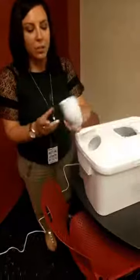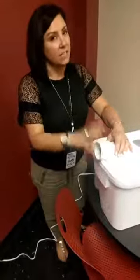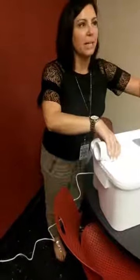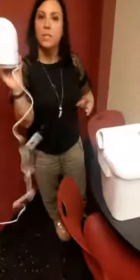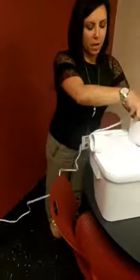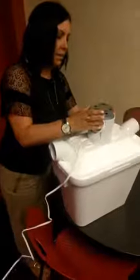A standard styrofoam cooler — it's the poor man's air conditioner. These little PVC pipes are about a dollar at your local hardware store; you can use metal ones too. It's a small cooler so it's not going to give an arctic blast, but it should work. Fill the cooler with ice, cut holes in the lid based on your fan size, and place a small fan on top. If I turn the fan on — oh wow, you can feel that! Blessed cool air coming through. It's working!